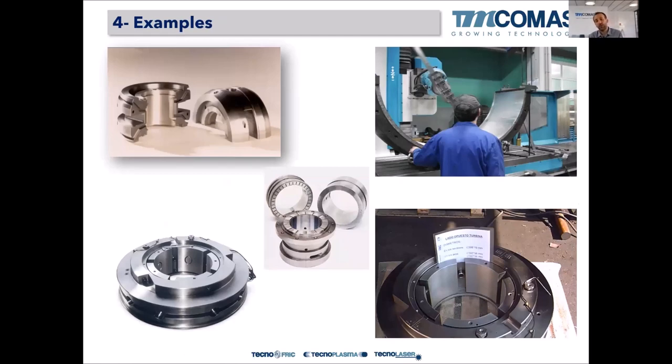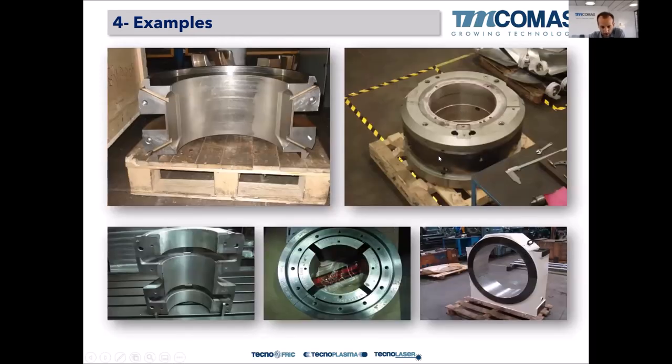So now, once we have talked about metallurgy, manufacturing technique or repair technique, and quality control of the Babbit bearing, let me show you a lot of examples. I am not going to explain every bearing because every bearing is different. You know how they work. So just a brief overview of what we are able to do. We can do pads, radial and axial bearings, journal bearings, big bearings for iron ore or coke milling in coal powdered power stations, diesel engine bearings, and nuclear ones for nuclear alternators or generators.